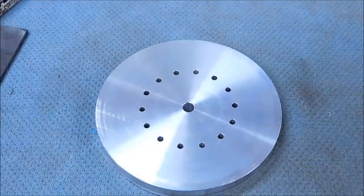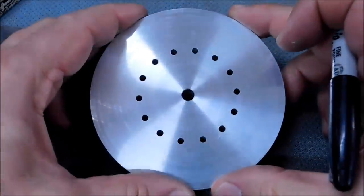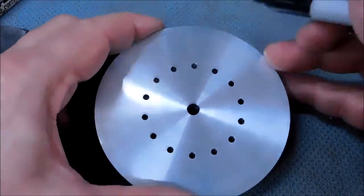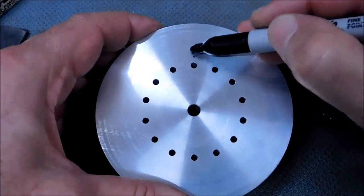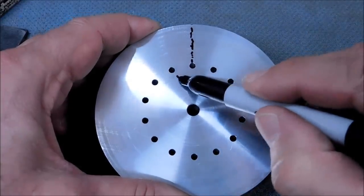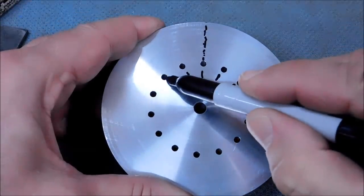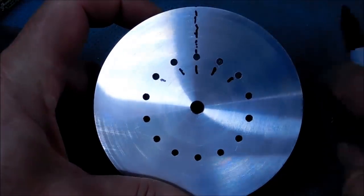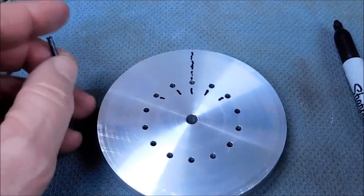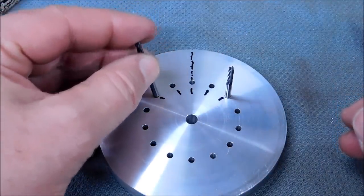So now you have a plate with 14 holes in it, 14 holes that are evenly spaced. You want to translate this bolt pattern to the outside of the part. Now you have several options here. If you want to transfer the holes in line with the existing hole, that is not a problem. We know that the angle relationship between all of these holes is exactly the same. I'm sure you can just see it falling right out of there now. If you want it right in line with one of the holes, let's just say 1, 2. Boom.